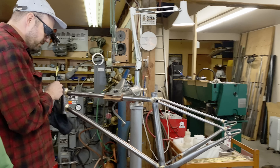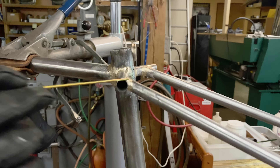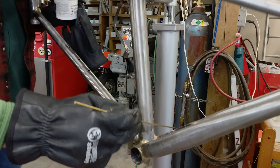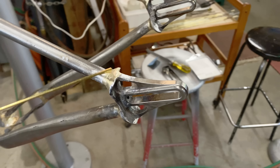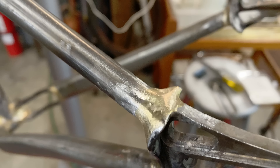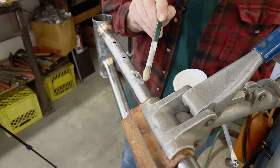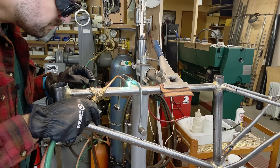Here is Thomas's frame — he's got a couple of features here. This is a seat stay that wraps around to give clearance for the tire. There's a yoke down here for clearance at the tire, chain rings, and sliding dropouts. You can see the brazing — it's had some filing, it's acceptable. Frame number five.